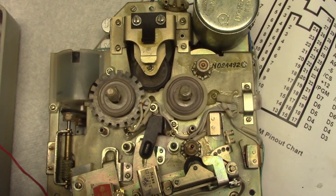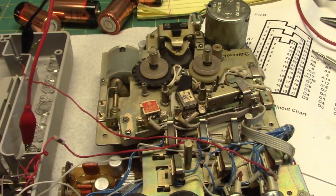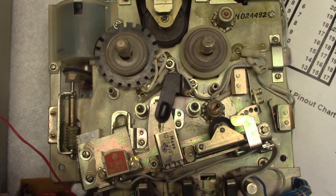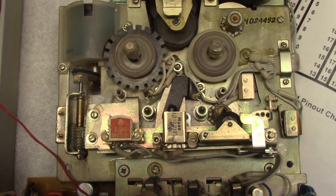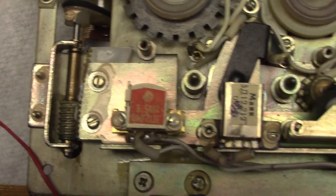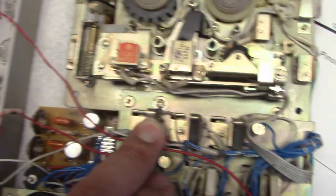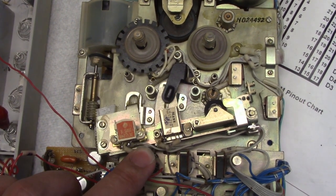And here's the inside mechanism of the Topaz D202 cassette tape recorder from 1985. You gotta love the Soviet engineering in this thing. It's quite fascinating. You can see that the heads are at an angle, interestingly enough. When the machine is started, this motor here drives a belt, moving this worm gear, moving this gear here to pull the heads and pinch roller up. Now, of course, this switch is normally always on whenever the machine is turned on and held down by this little mechanism over here, so I'm having to manually do it, so excuse me. I have to do this first and then do that to see it stop.